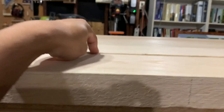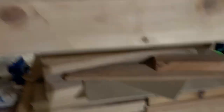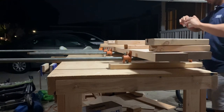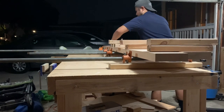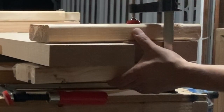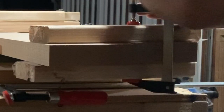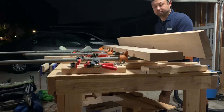When I brought the wood back to my workshop, I noticed there was a bow in a couple of pieces of lumber that created a little bump. The plan was to get some scrap 2x4s to make some cauls using packing tape, and hopefully clamp it up during the glue-up to get the bow right out. Once all the cauls were made, it was the moment of truth — time to test if this was actually going to work. And as you can see from that slow-mo, it got rid of the bow perfectly, making it completely straight, which made me really excited to move on with the glue-up.